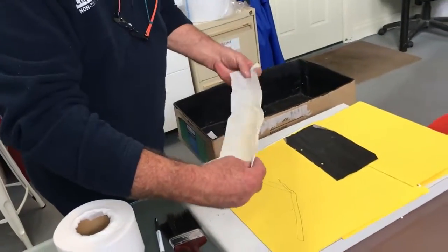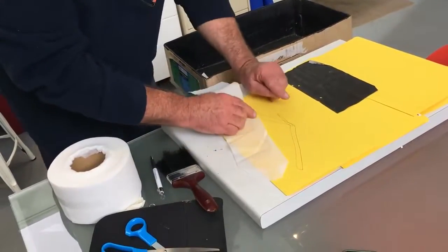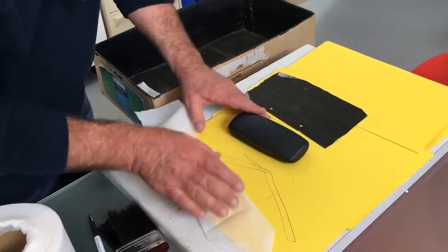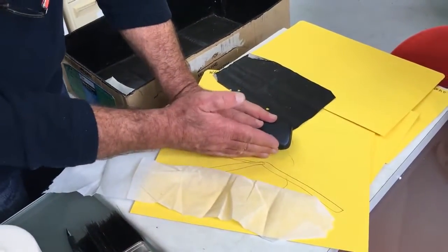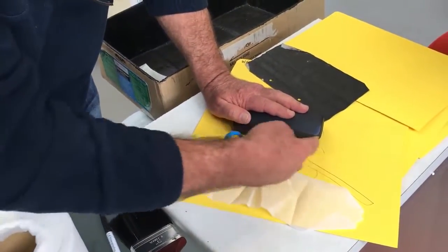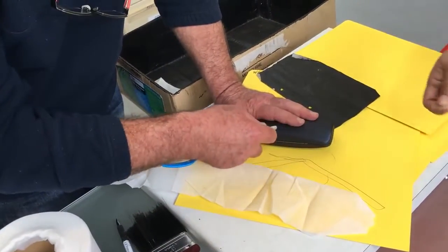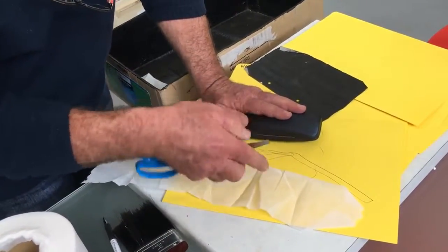Similarly, when you're coming into a corner, if you've got where your windows are on your place. Yeah, that's what I was concerned about. So your windows are quite close to the roof in your situation. Let's call this a window here. That's a window frame, a bit of glass in here. So there's the edge of your timber frame there. That's got to be cleaned as well. So you probably need to get a chisel and scrape all that rubbish off the timber, because it's got lacquer and polyurethane, whatever it's got on there. Oh, and pull out all of the silicone? Not necessarily. No? No. If it's still in okay condition, what you'll be doing is coating over the top of that.